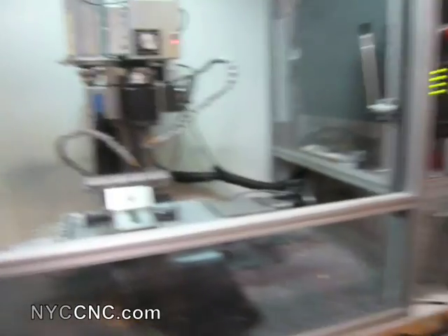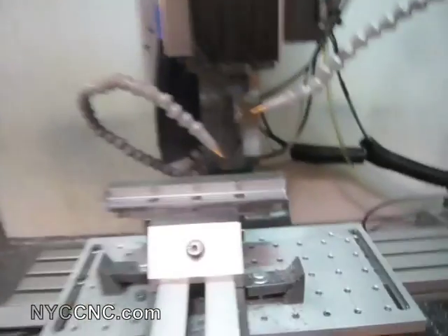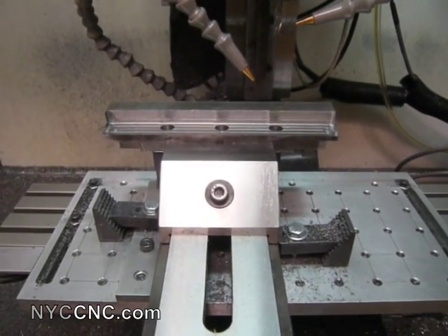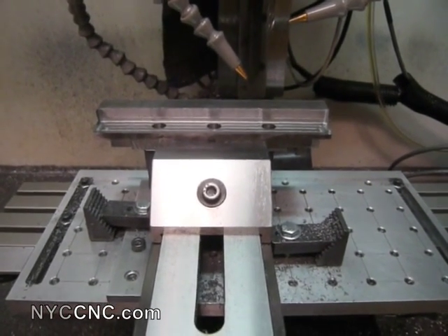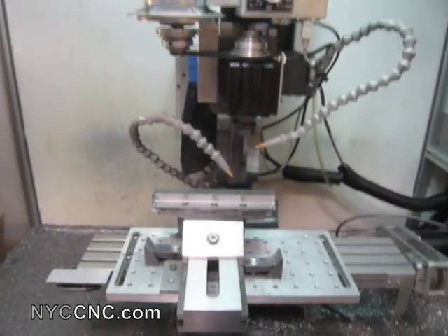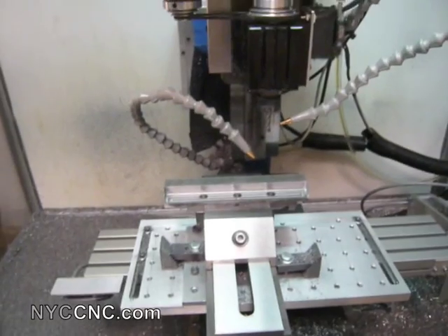Compared to 1018, I've been able to cut that at about twice the material amount — a little bit faster RPMs and about double the inches per minute.